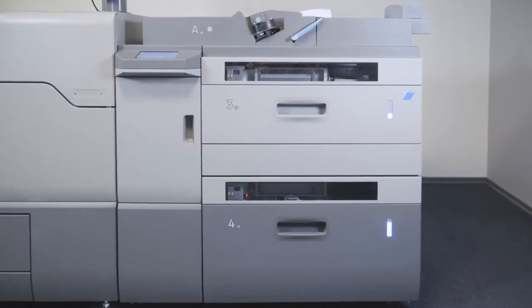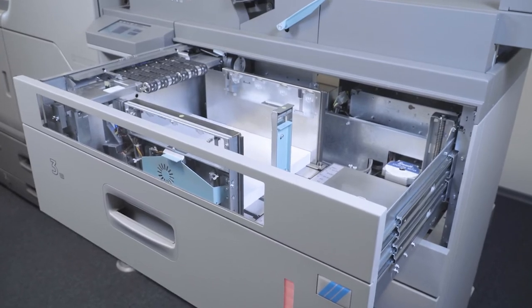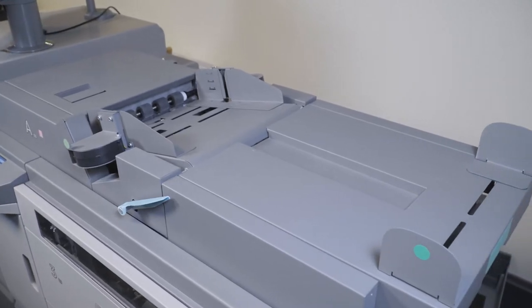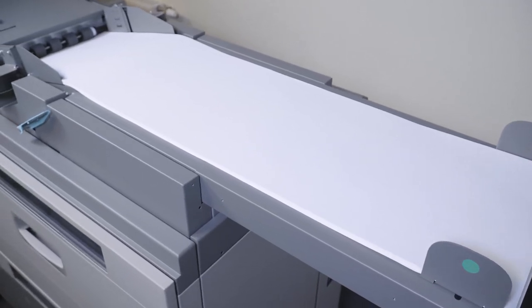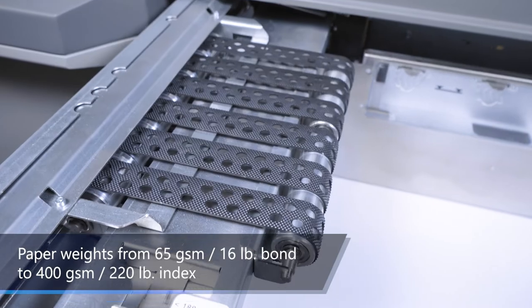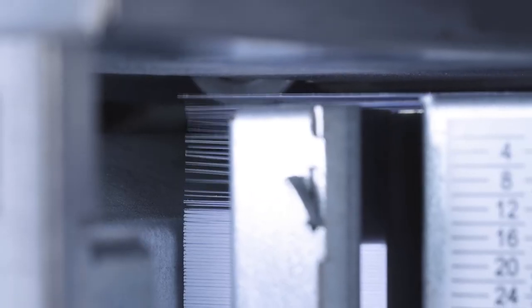The LCD 3500 contains two oversized high capacity paper trays. The unit is able to feed long sheets up to 700mm or 27.5 inches long on a variety of stock with weights up to 400gsm from two vacuum trays. With the optional LSM Long Sheet Module, sheets up to 1260mm or 49.6 inches can be fed. Ultrasonic sensors prevent double sheet feeds, and a vacuum feeder consistently feeds media ranging from 65gsm or 16lb bond all the way up to 400gsm or 220lb index.